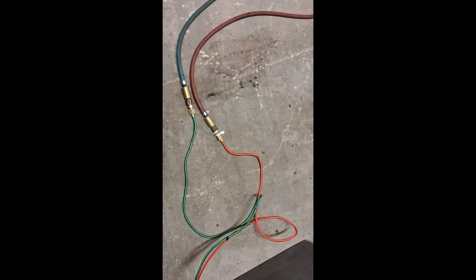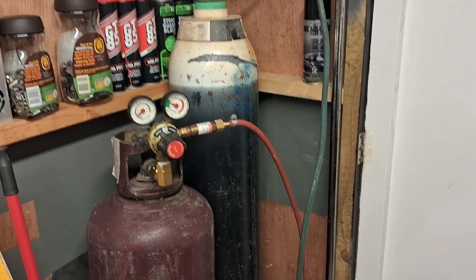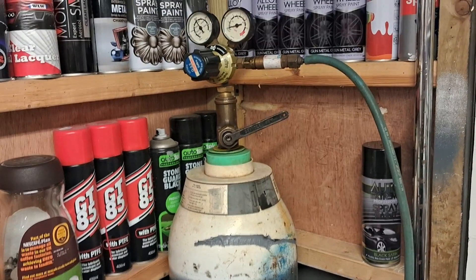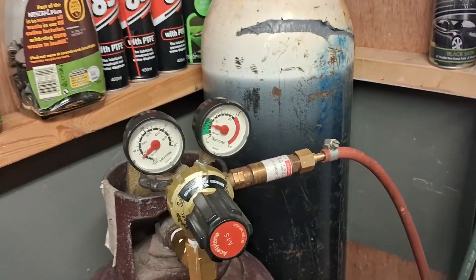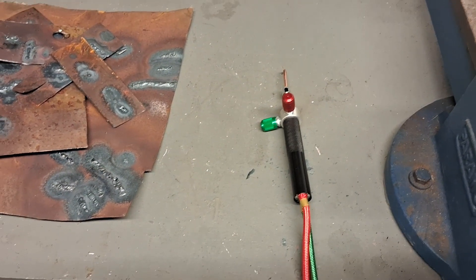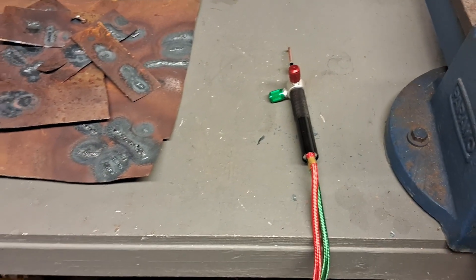The sniff test is always something I perform. We've resealed the acetylene joint, done the sniff test — no acetylene leaking. You can really tell by the smell; acetylene has a horrible smell, and there's nothing there now. We're ready to light up. I always have the flashback arresters on — I think they're so important. Even though these little torches seem like a fun craft toy, you are messing about with dangerous gases, so it's important to have your flashback arresters on.